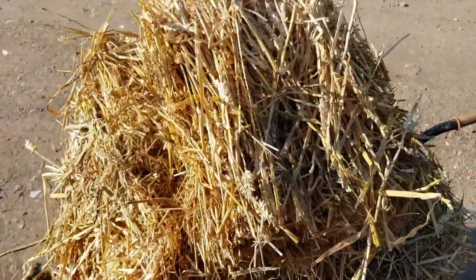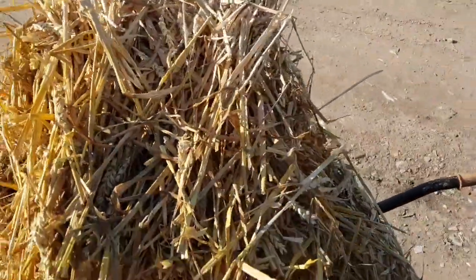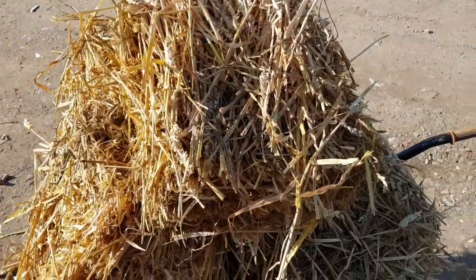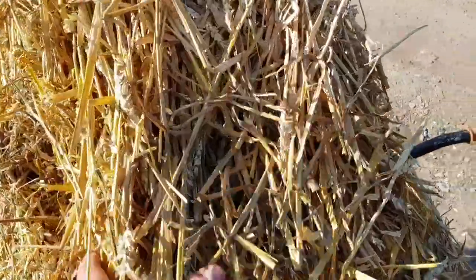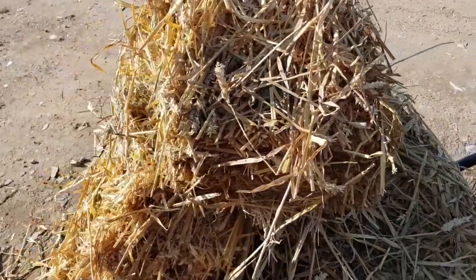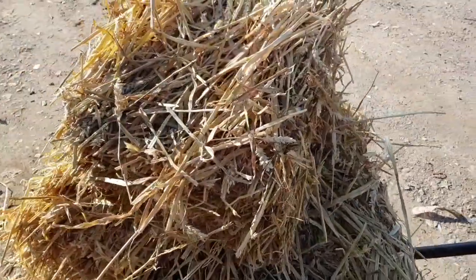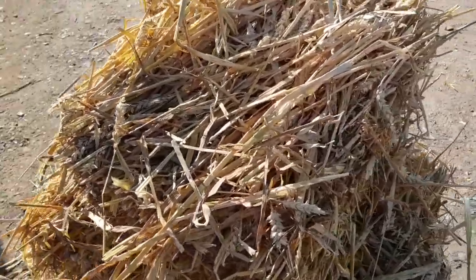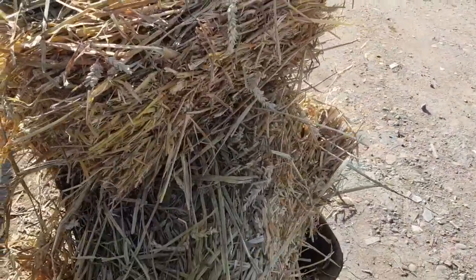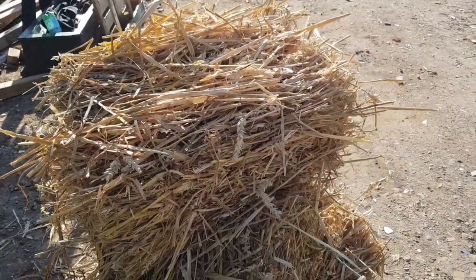Now this stuff is the absolute key to this roof being really cheap and really easy to do. Now you're replacing a large majority of stone and soil that people would usually throw on a green roof with straw. Now this is ridiculously light obviously, even when it's wet it's way lighter than you could possibly have if it was all soil. Makes sure it's good drainage, as well as it also retains a lot of moisture. So you've got a win-win with this. It's great for grow beds anyway, and great for green roofs. Right, let's get this up there.